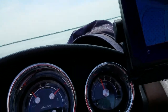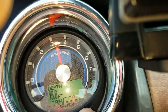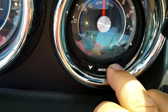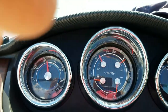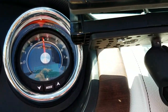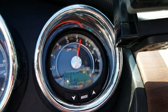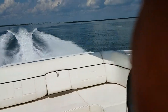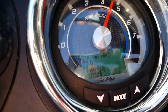I'm going to kick it just for a little bit so we can see full power. That's depth, that's temp, water pressure at nine pounds — that's good — and volts. 3,240 RPM, 77.8 hours. Okay, full power — here we go. 4,300 RPMs, 44 miles an hour, temperature's good. 4,500 — that's all she's got — 47 miles an hour. Very good.